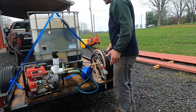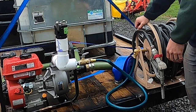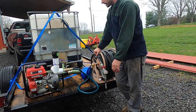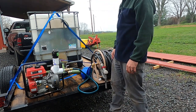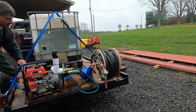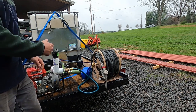The next stage in this setup is our pump here. The electric 12-volt pumps are really nice and quiet. You could pick one of these pumps up for like $250 at Harbor Freight or Northern Tool — all these places have these little pumps. Go get a Honda if you want. This is just a $250 two-inch semi-trash pump. It runs really quiet and you barely have to crack idle with it. Right there is about all the idle I need to pump — when it gets a little colder I throttle it up just a little bit more, but that's about it.